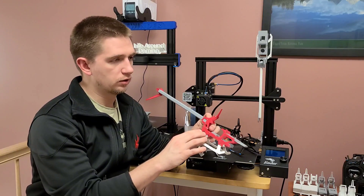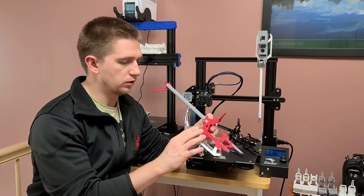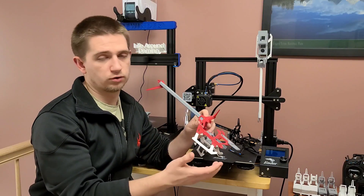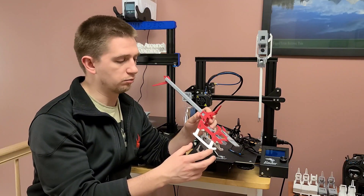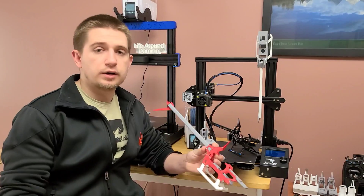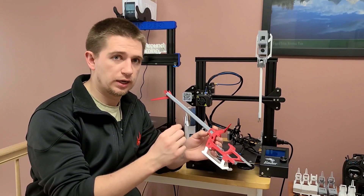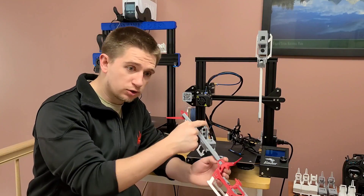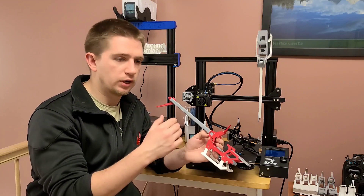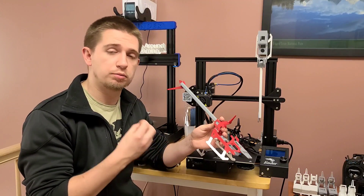This was my first prototype. I started with PLA parts but then slowly transitioned into PETG parts, because PLA is very weak when it comes to heat and it'll start to deform a lot faster — so if you're flying outside, you'll end up with a completely deformed RC helicopter. Since I was using the original hardware, I was really trying to aim for the hole tolerances to be smaller so you could press fit the machine screws into the plastic. Eventually, I definitely recommend using self-tapping screws — it is a much better option for assembling plastic pieces together.